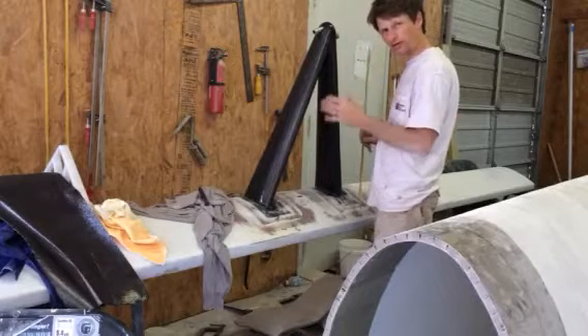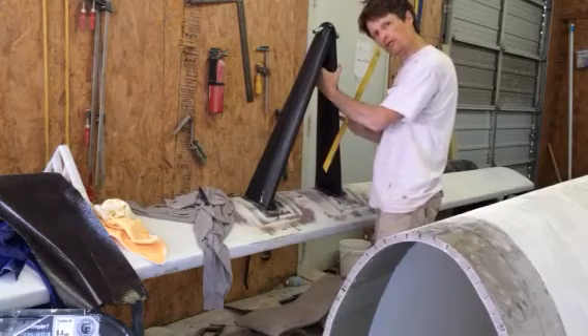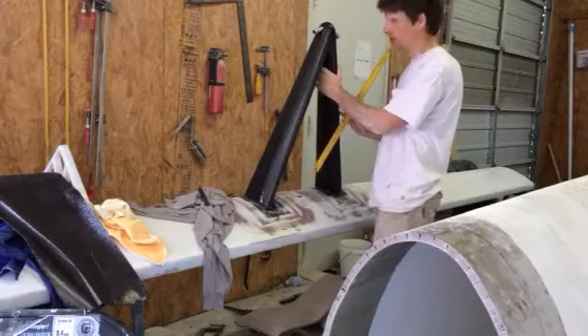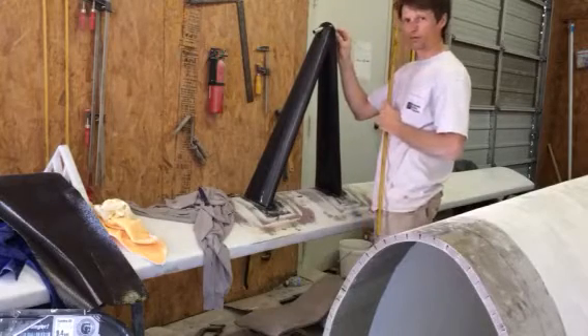The core is just four layers of 13 millimeter foam all layered on top of each other shaped like a wing, covered with a 400 grams per square meter biaxial fiberglass, really just to hold the shape. Then I cut a slot in the top and sanded it until it matched the curvature of the aluminum tube.